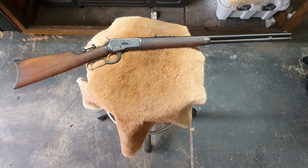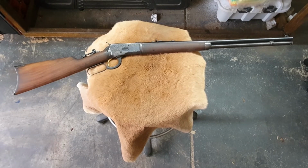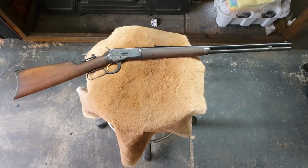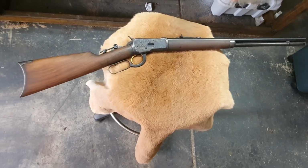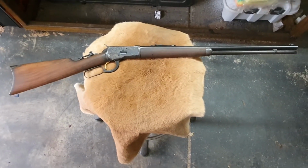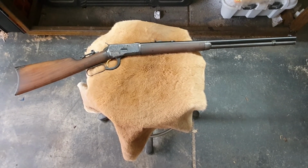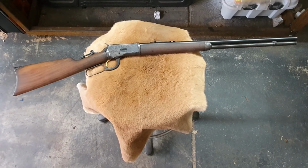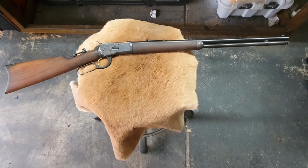So instead of spending thousands of dollars on tools and then 20 years of my life getting to that point, I pay him a very respectable price, and he does my guns for me, in the fact that I prep the receivers. So I file finish all of my receivers, all the parts that are colour case hardened. I will metal finish those parts to a 400 grit finish, and then I post them to him through the gun shop. As you have to in Australia, you have to post everything through a gun shop, through a repair program. So once my gun shop sends the part to him, Rod colour case hardens everything and sends it back to the gun shop. Then I go and collect it.